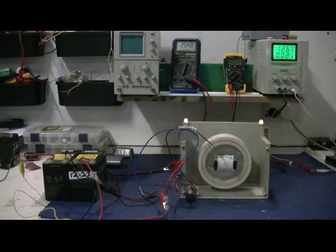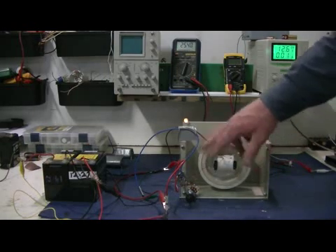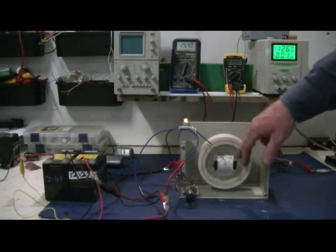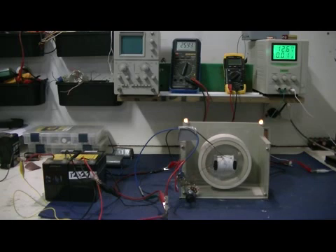So it's happy to run at around that speed, between 10 and 20 milliamps. Having the coil — whichever way you do it, whether you've got two rotors linked together — I'm not sure about the U-shaped coil; I think you'd lose too much of the magnetic flux through the ring. But having the coil in the middle definitely works really well, and it's quite happy to tick along at that speed between 10 and 20 milliamps. And there's plenty of power left to drive our little generator at the back.